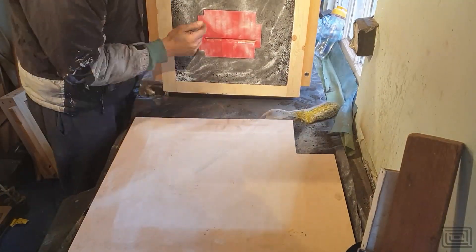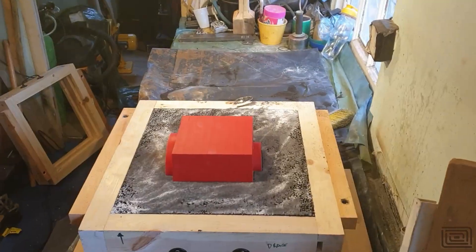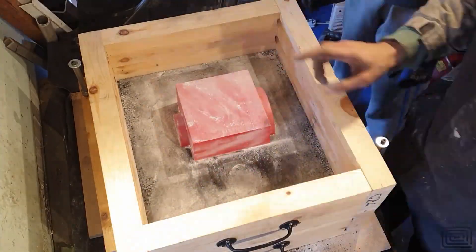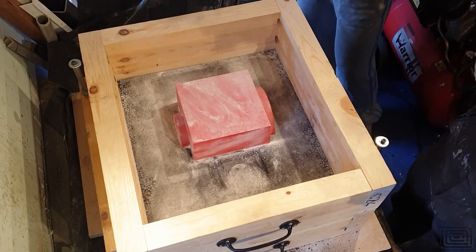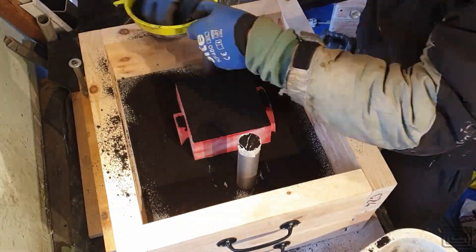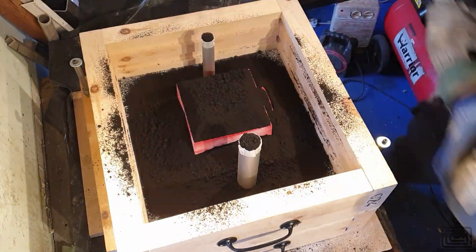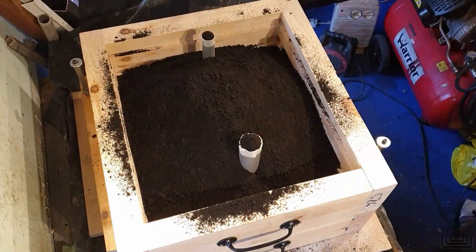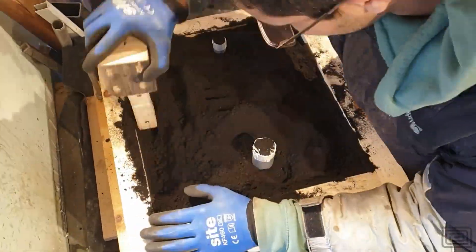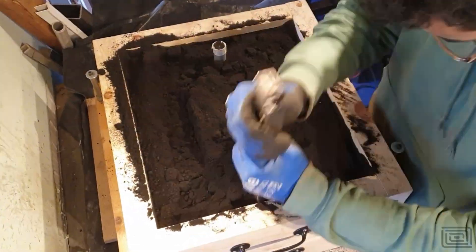Over here I'm preparing to put the gates into the mould. I put the gates into the drag and then connect them up to another gate in the cope section, which connects up to the sprue where the metal is introduced. A big problem in this particular setup is that I've forgotten to include a riser — both a blind riser and a top riser — and this causes some shrinkage problems which will be very apparent later on. You can see I'm using a finer-grade sieve to get facing sand on the part, then filling the rest with bulk green sand. I tend to find you don't need to ram that hard; I always start from the outside, compress the edges, and then go around any sprues or riser sections.